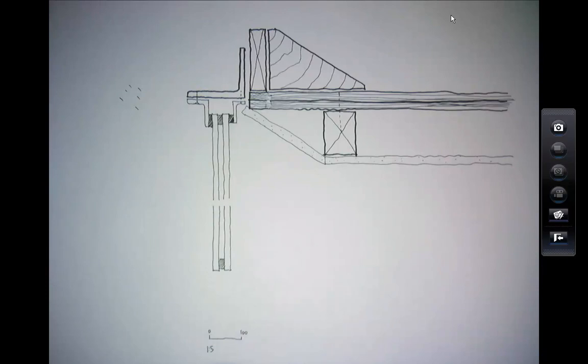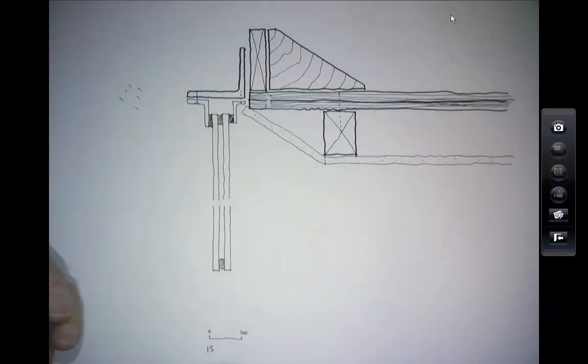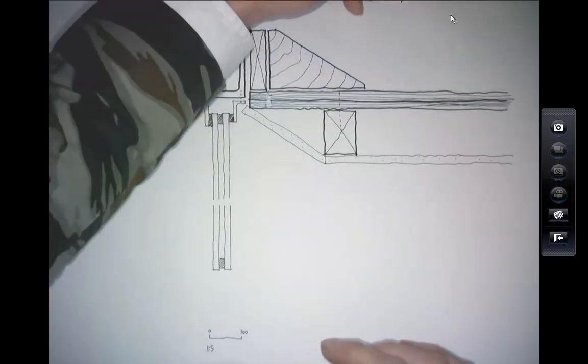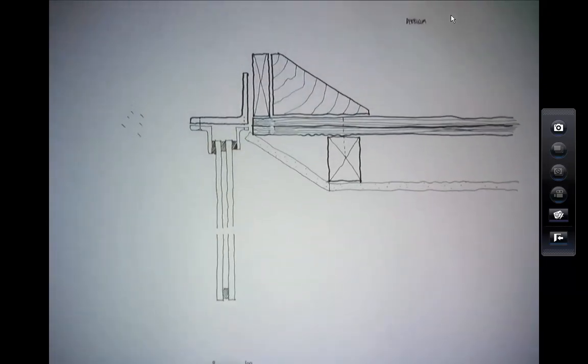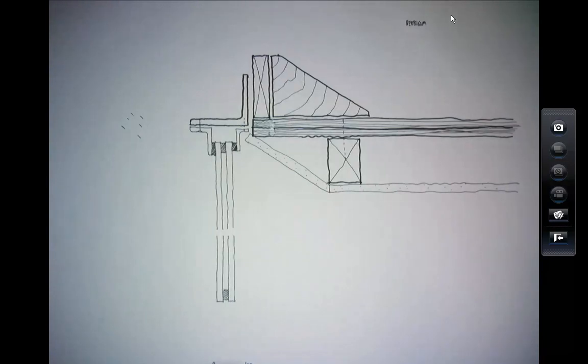What they've got on this building is a single ply roofing membrane — like a thin sheet of plastic. It's not my favourite roofing material; it's prone to leaking because if anybody stands on it on site and puts a little hole through it you won't know until the rain starts coming through. We did a piece of research at BDP where we researched 20 roofing types and found single ply was performing the worst.